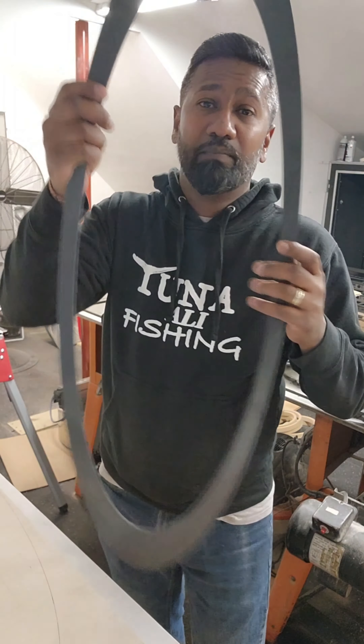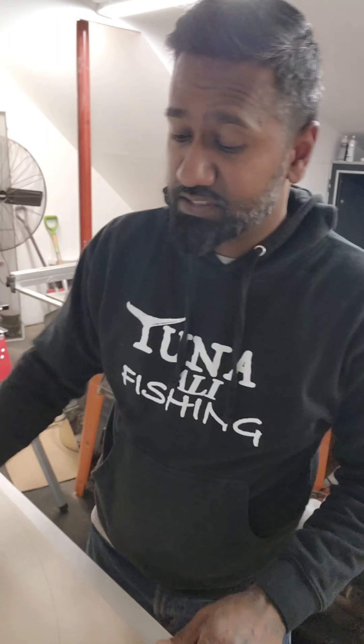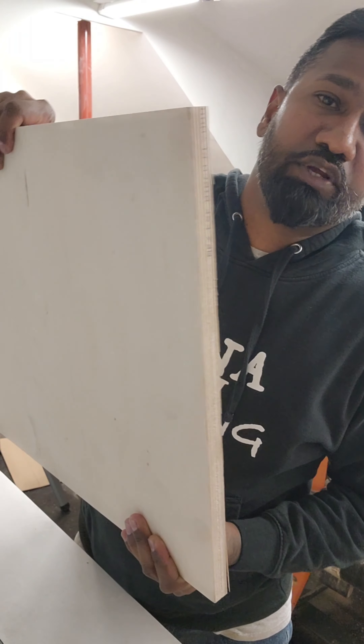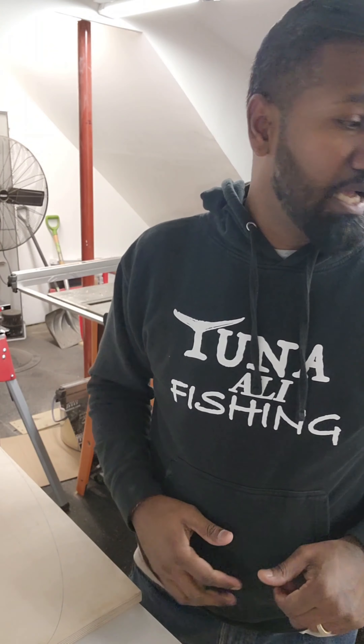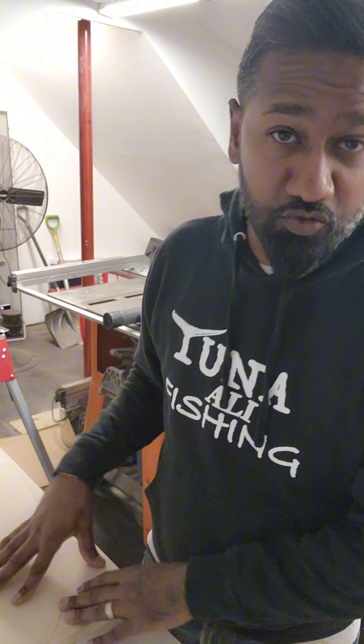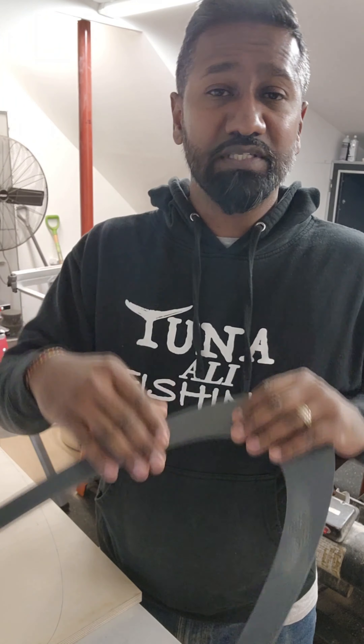We're starting off real simple. Back in the day I never had templates — now I do, so I'm going to use them. We're going to start out with a piece of three-quarter inch birch as our baffle mounting and we're going to transition over to the grill, which is going to be a piece of half inch MDF, which is going to allow us to show our chamfer bit and multiple stacking of templates for our quad bearing bit.